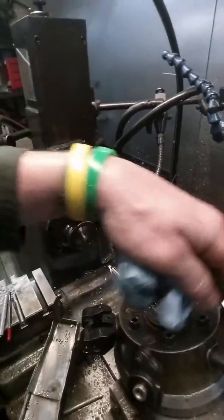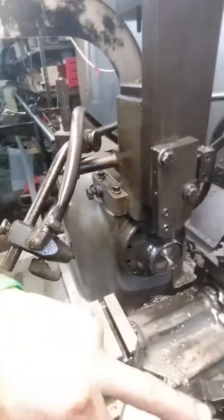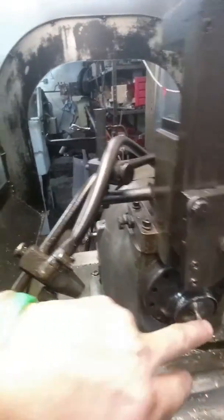I'm gonna use this little pedestal grinder to grind in the tool so I can get my little notches on the side. This is a 1976 Hardinge HIC chucker — isn't it a beautiful machine? We need to set our tool post height so that the cutter cuts. We've got our turret all ready with all the tools: center drill, drill, tap, bump — the stock will come out, bump it, then finish length with a little taper on the end, then knurl it, then cut the ball with this tool, then cut it off.